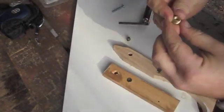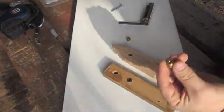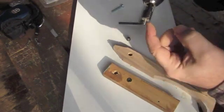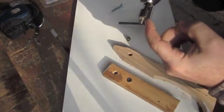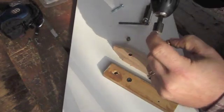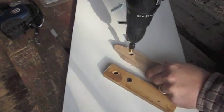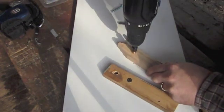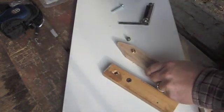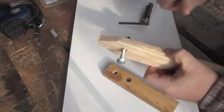Hardwood is a little bit different — this one has a different type of mounting, it's got a slot. So do yourself a favor, make sure to get the installation tool. It has two features: one is the spaded bit, much like a screwdriver, but it's also got this little ball on here so it actually holds your insert, and then you can just drive that in there. And then you've got your threaded insert all set to go.